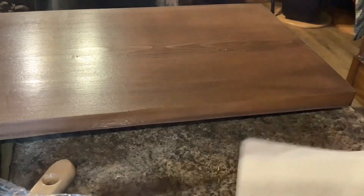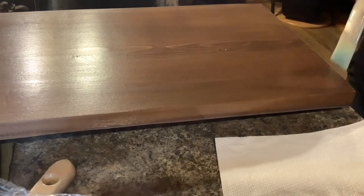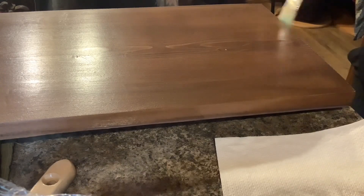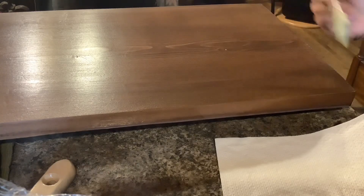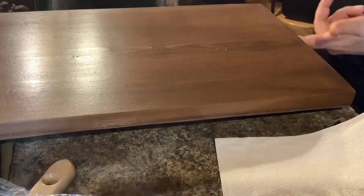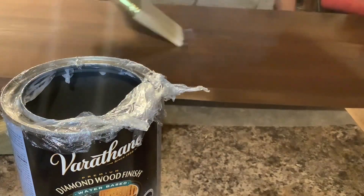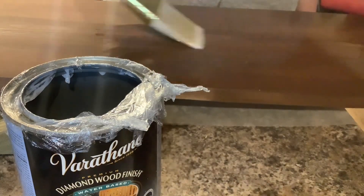But because this is the back, I want to get to the front to show you guys the front. My clear coat — I'm going in now with a clear coat, and I am doing the sides and edges first, because I actually want those to have the most amount of clear coats on them. The sides and edges — and especially the bottoms and the top — take the most abuse. And the bottom, in case it's sitting in any snow, you want to make sure that's sealed really well. And the top is going to take rain, snow — it'll take a beating as well. So now when I do my clear coat on the back of the sign, I've switched to the bigger, softer brush as well.